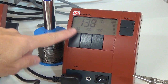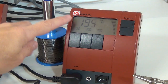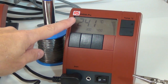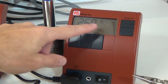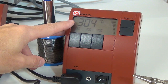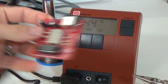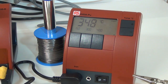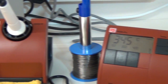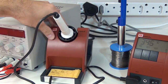You can set default temperature ranges with the buttons or manually adjust degree by degree. It has automatic power-down behaviour: once it reaches the set temperature — around 350 degrees at the moment — the power bar comes down, and as you start cooling the tip with soldering work, the power pops back up to reheat. From the little bit of soldering I've done on the circuit, it has worked a charm. I do have some criticisms though — the cradle for the iron I wish were a little heavier, and the cable can catch on the metal piece at the front, which I may add some metal trimming around.